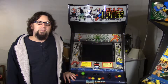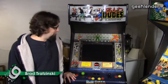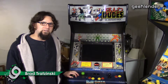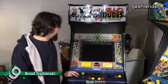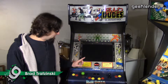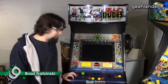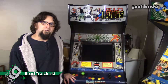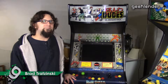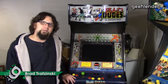Hello and welcome to Part 3 of the DIY MAME Seamless Arcade Machine project. Today we'll take the inner LCD monitor mounted inside and bring it forward to make up the difference for the convex shape of the old CRT that was in there. We'll also wire up the controllers, get the computer set up, assign buttons, install HORM (Hibernate Once Resume Many), and wrap this project up with some testing. I think I'll start by wiring up the control deck.